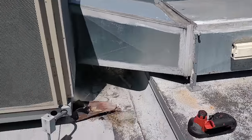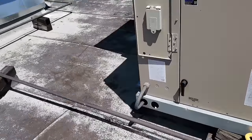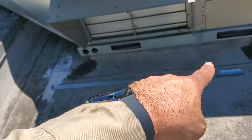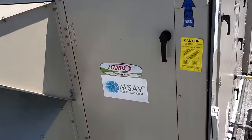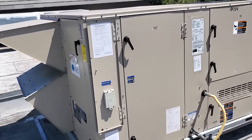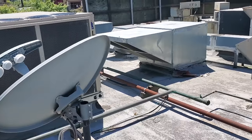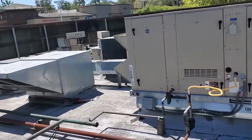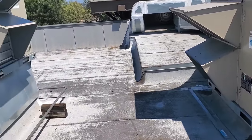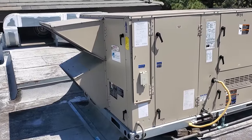I don't have any sheet metal to cover up the old duct detector hole so I left the duct detector there, cleaned up all my messes, and I still need to get a cap for that j-box. The filter changing company always takes out the filter pullers from all the AC units. I went through and adjusted the outdoor air dampers for building air balance — air balance is much better now that the ACs are working. I also programmed all their thermostats to run the fans continuously in occupied mode. Everything else is working — makeup airs are working, exhaust fans are working. As far as the smell goes, it's possible the AC not working and another AC not being programmed right was causing the building to be at negative air balance.